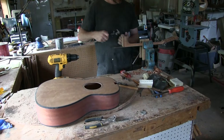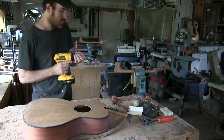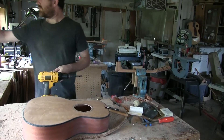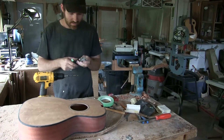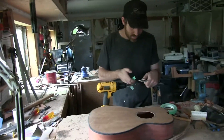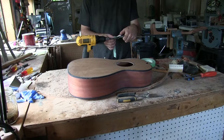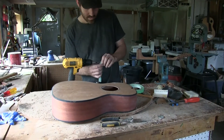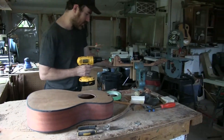The idea is to have it so it's way into there and it's kind of reinforced. So I will take a piece of masking tape and mark it at approximately an inch — a little bit less than an inch, let's say nine hundred thousandths of an inch — just in case. And right there, there's my tape marking, and I'll have it centered on my dovetail.